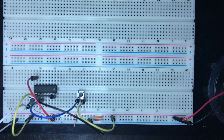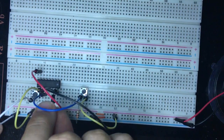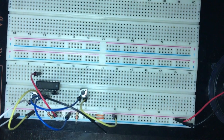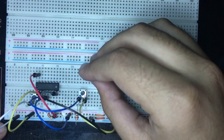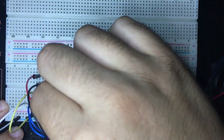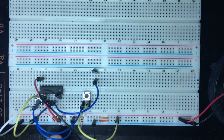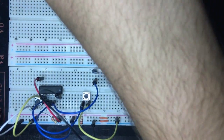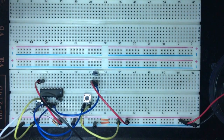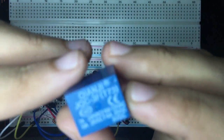The Set (Preset) pin is connected to VCC. Now I'm plugging in the NPN transistor. The middle pin (base) connects to Q, which is pin 5 of the IC. Pin 1 of the transistor goes to VCC, and I'm plugging in the 5V DC relay.